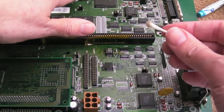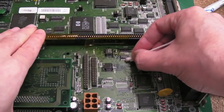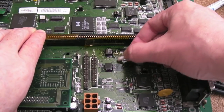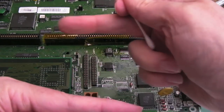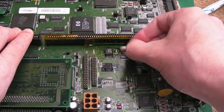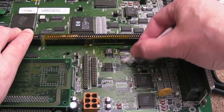I found a weird signal on one of the PLDs up there, the GALs. You could see some little square waves coming out of those PLDs to do with the DRAM timing, the RAS and CAS signals and things like that, that go to the SIMMs. Every other pin looked normal, apart from one, where instead of going to ground, it was at the top, bumping up and down at sort of a 4 or 5 volt level. But I compared it to the other board, which does exactly the same and works, so that was kind of normal. Beyond that, I really did not know which way to turn with this.